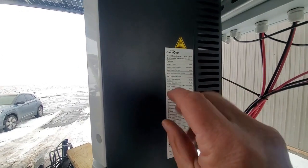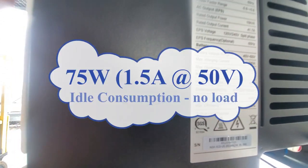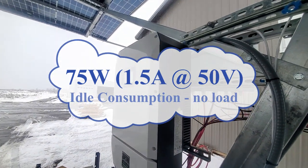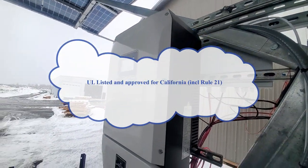Okay, and this is a 10 kilowatt unit. The maximum rated output power is 41 amps per phase. And the battery voltage range is 40 to 60 volts. Maximum charging current is 190 amps. And I'm standing right next to this thing. You can hear how quiet this is. I mean, literally, I can whisper next to it. It's probably the quietest inverter. And it's also outdoor rated IP65, and that's why we have it outdoors over here. Just maybe under a little bit of awning, but the snow can still come in from the side and sits on the top there now and again.